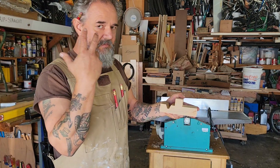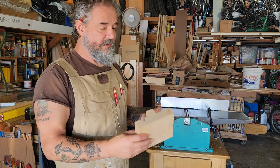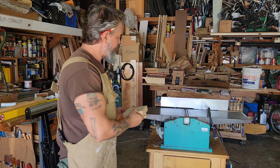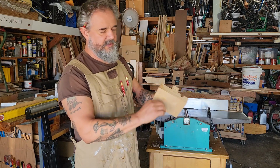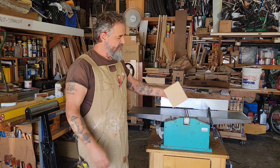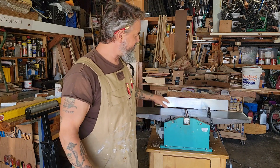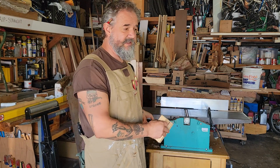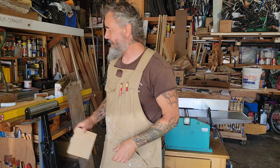and you have to keep that in mind. But again, you put your cup down if it's possible. Run it on the planer. If you have to run it with the cup in this direction, that's fine too. You just have to be aware of what you're doing. But again, once you get a face joined, resaw it, let it sit overnight, come back the next day, you're going to end up with a board that's going to remain stable.